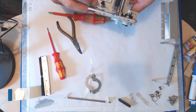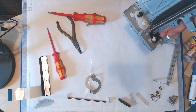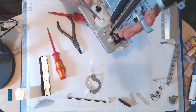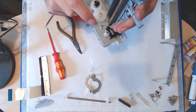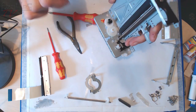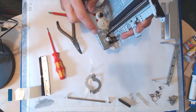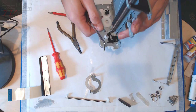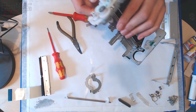This one goes to here, but it doesn't go round all the way — there are teeth here but they stop. I can turn it that way and it stops, and that way and it stops again. It looks like it's lifting something up and down — possibly as part of the feed mechanism. It will lift up, draw paper through, then push down and clamp it in place, then pull it through to print, then lift up for the next page. That won't need much torque because of the gearing reduction.